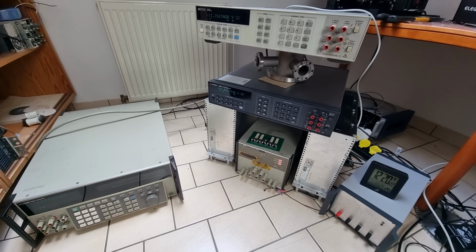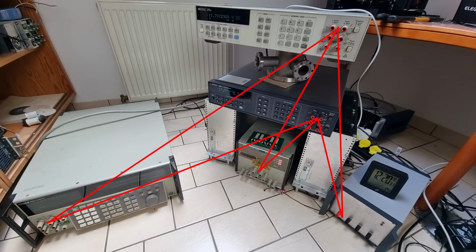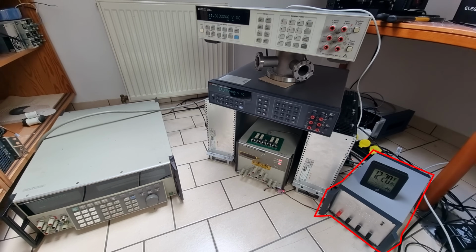Speaking of long-term, I've sent the whole gang to a room of their own for a kind of group bonding activity. I want to compare everybody to everybody else, so that, for example, if one voltmeter claims that LTZ mu over here has lost a ppm, I can always get a second opinion from the other meter. And if both agree but claim that Fluke 732A with its 30 years of certified stability lost a similar ppm at a similar time, I would have reason to believe that we've got a more systematic problem on our hands.